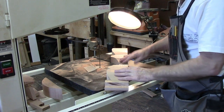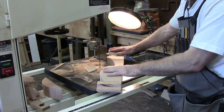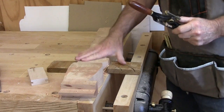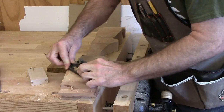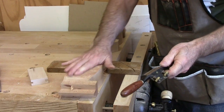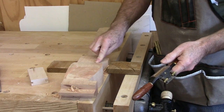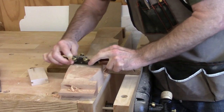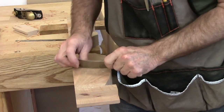It's cut out in both directions now, so it's a matter of cleaning up all the bandsaw marks and getting it nice and smooth. After bandsawing, the face of the apron is pretty rough, so I'm using a spokeshave here for final shaping, and then probably a card scraper to finish it off. I'll need to use a chisel wherever there are sharp corners to get them crisp. With a round-bottom spokeshave it just follows the curves nicely.